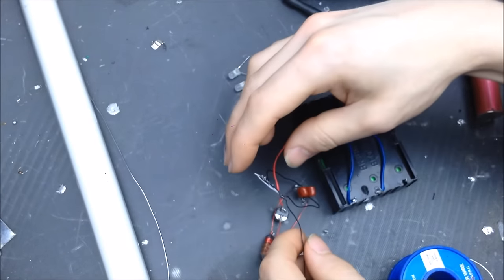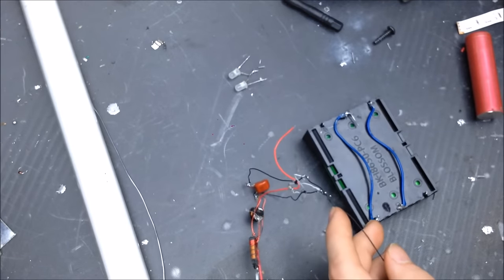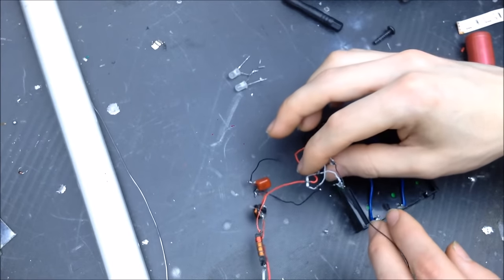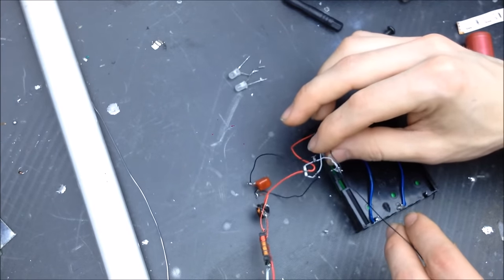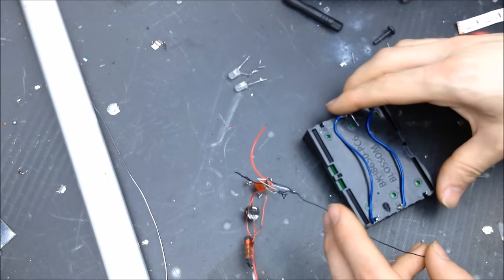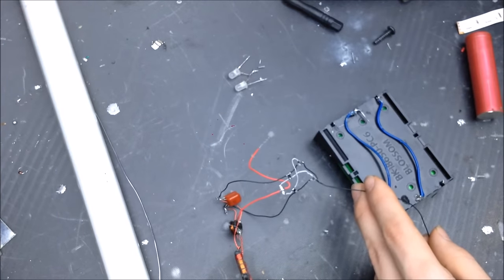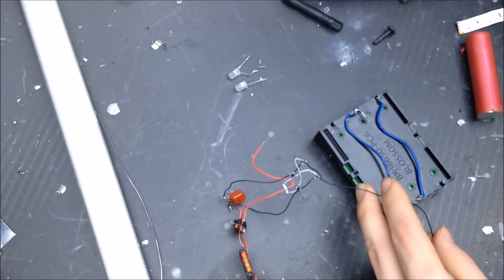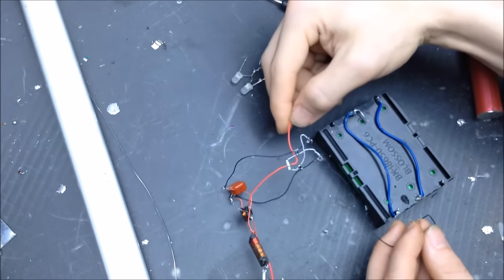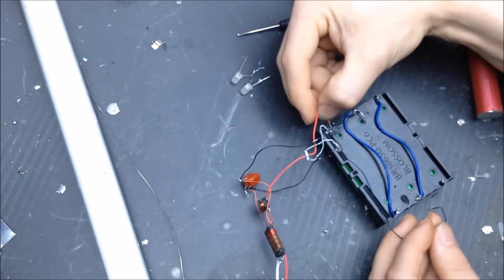Now, I said, technically the numbers do work out. They're not going to be overcurrenting or overvolting the gate. Well, what simply is going to happen is that the MOSFET is going to get so hot that it's just going to kind of melt like a muffin in the rain. So, here's our circuit. We're going to see how long it actually runs in real life. Place your bets, folks. Will it last for more than half a second? Let's find out if it even lasts that long.